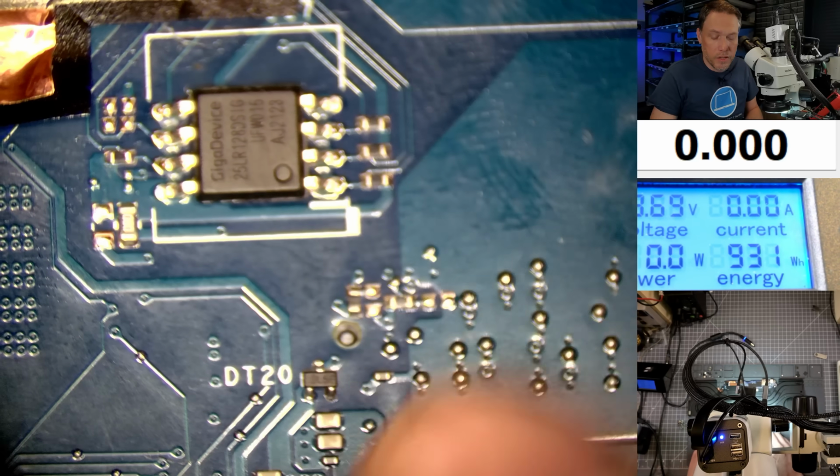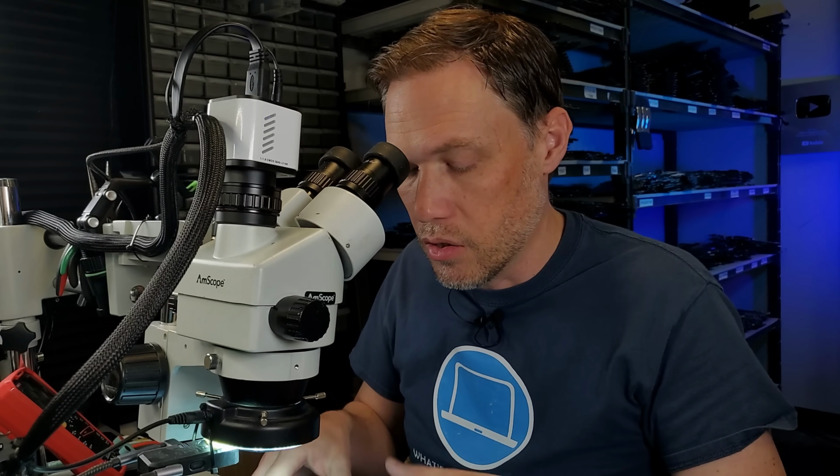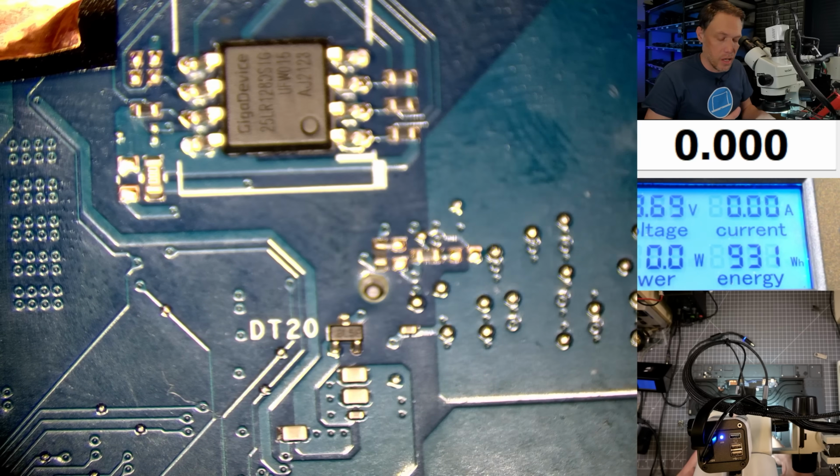So when you have the AMD Ryzen edition, we can actually take the BIOS recovery file from Dell. We use an extractor and it will pull a BIOS portion off of that. And we can actually write that straight to the chip. We don't need to do any injection. I'll back up their contents just in case anyway, but we should be able to just write straight to the chip and it'll turn right on.